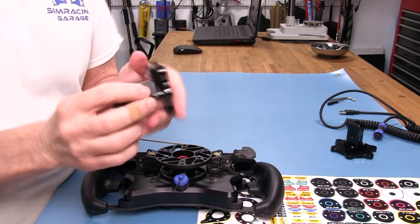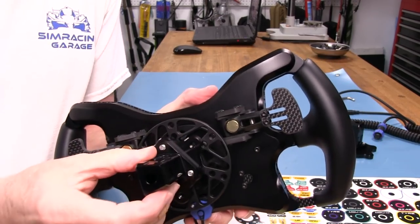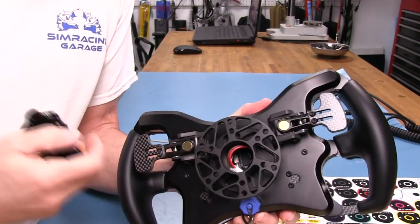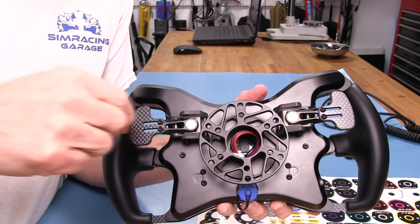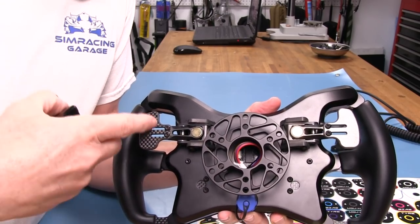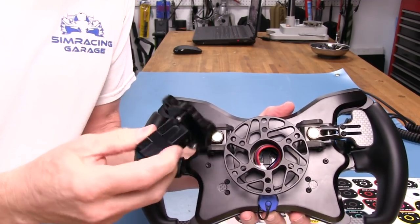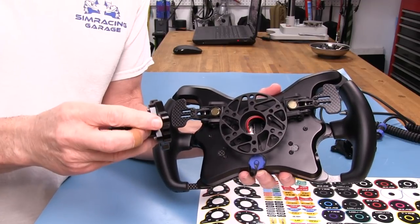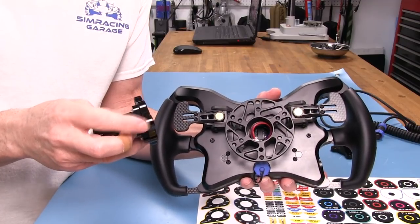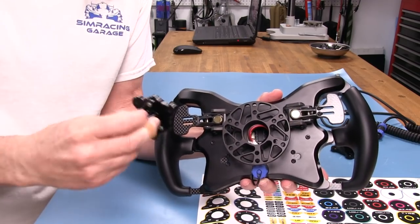But if you're trying to go from a threaded hole into another threaded hole, if I had this threaded hole lined up with this threaded hole, it's likely going to be a problem when the screw comes out this side of the flange and starts to go in that hole. It's not going to match up, and you can't adjust the distance to get the thread to match up to this thread. So this can cause a problem of being able to screw it all the way on. The only thing to cure that would be a captive type of bolt or screw. A captive is where the section next to the head of the bolt or screw is smooth, and the threads are introduced at the end of it, so you can thread it through this and it'll be loose so we can turn it as much as we want. Then we thread it in there, and it pulls tight.